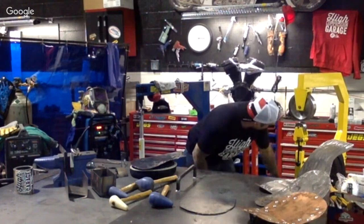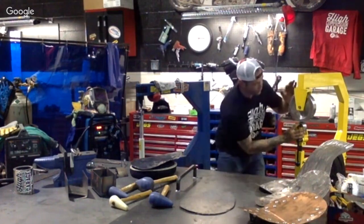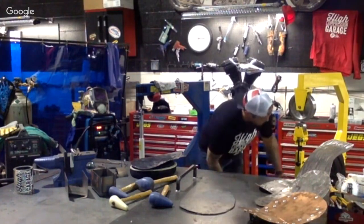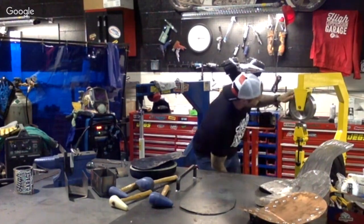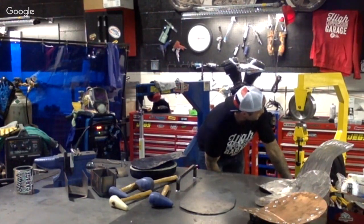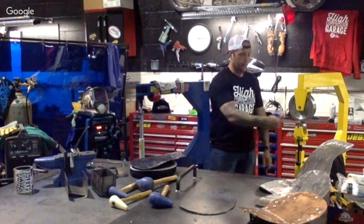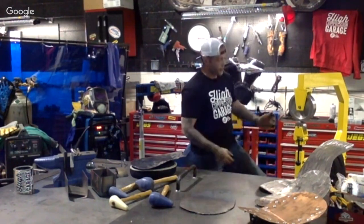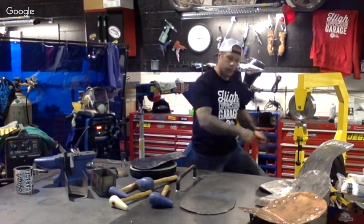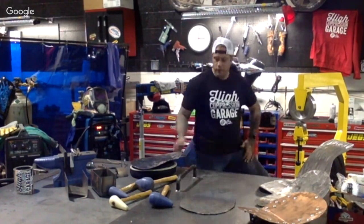And what we're going to do, there's a little gap in between the two wheels here. Hopefully you can see that. We're going to start using the bottom handle, bringing it up. We're going to spin the main wheel just till they touch. Oh no, just like that. Now that bottom wheel's caught on there. We're actually going to work in ½ inch increments, turning that wheel as we go through.